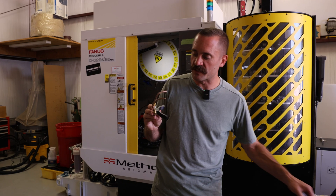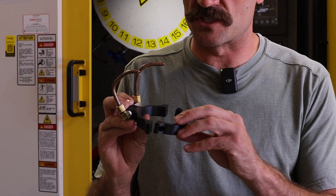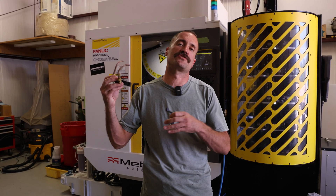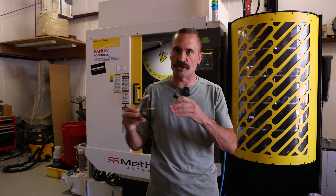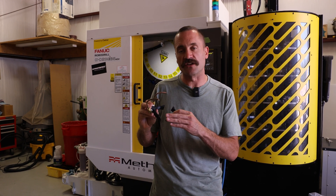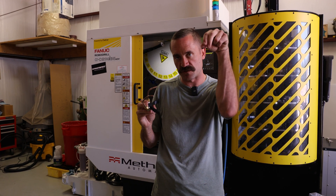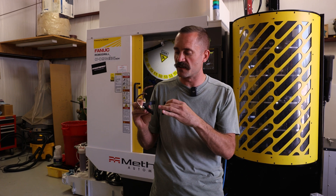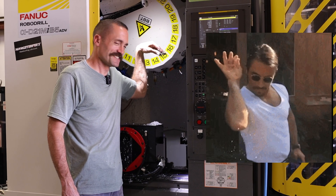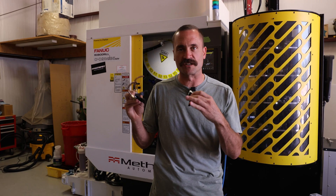We've printed up and mocked up just a very crude little air blast line system. We're going to tie it into the system, make sure that it's blasting air through the Renishaw tool breakage detection macro, make sure that it's clearing the chips. We're going to do a little test — sprinkle some chips on there. You might have heard of Salt Bae, but over here it's Chip Bae. And we're going to see what happens.